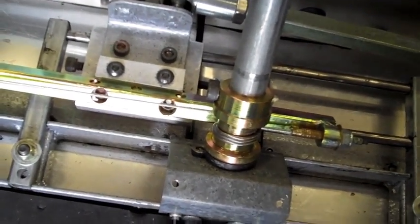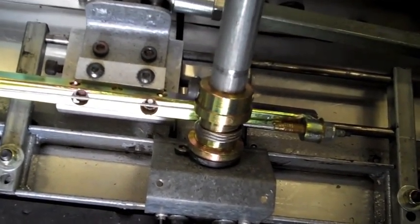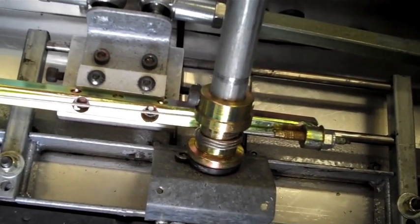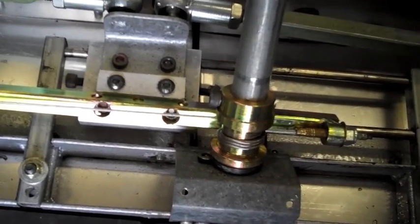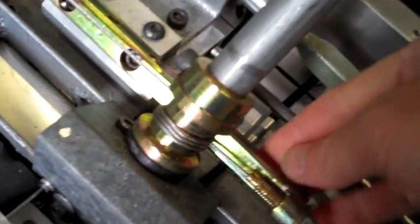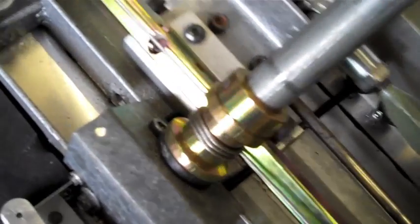The main advantage of this kind of steering mechanism over a rack and pinion is that this is buildable by yourself in a garage with simple materials, because it doesn't require high precision. A rack and pinion would be much harder to build accurately without specialist equipment, or you'd have to buy the rack and pinion which would be more costly — so that's why we've done it this way. The angle between the capstan and the bow can vary as much as you want, and the amount of clearance can vary quite a bit too.